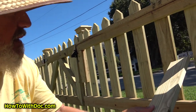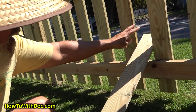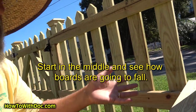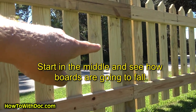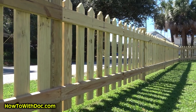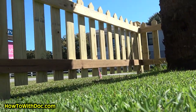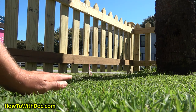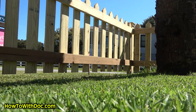For picket spacing: Kurt used a board as a spacer — three and a half inch picket, three and a half inch gap, repeat. When you reach the end of a section you can adjust the spacing slightly to make it even, or just leave it. Most boards are at three and a half inches, with a few gaps slightly wider. On the last slanted section, rather than following the steep terrain drop, I had them bring the rail up so it wouldn't look awkward — you can make that kind of adjustment.